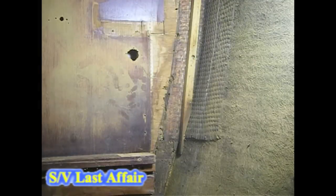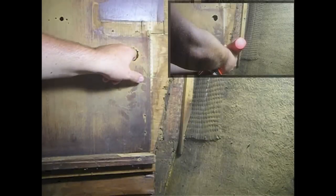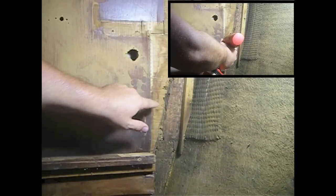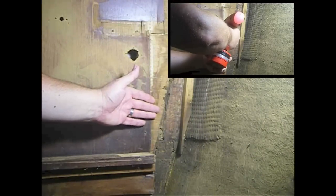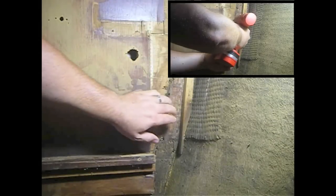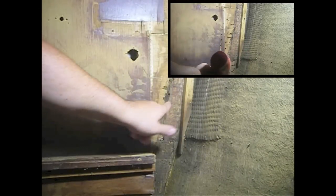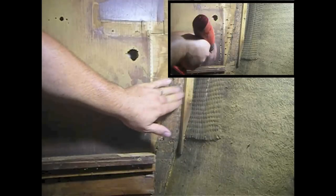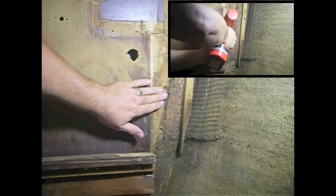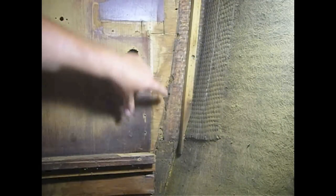The first step is ensuring it's completely dry according to the instructions. The next step is I'm going to drill several holes into this through the veneer, being careful not to go through to the other side. This will allow me to add the epoxy, let it hit the end grain of the wood and work its way down into the grains, essentially encapsulating or penetrating this thing and turning it into an epoxy resin solid wall. Because this is where the bulkhead is glassed into the hull — you can see the glass curved here — and because it is rotted just along the edge of that, I'm going to also be putting some penetrating epoxy right along the edge to help establish a tight connection and bond between the glassed-in section and the dry rotted section. It's about a four-inch swath right along here that's dry rotted.